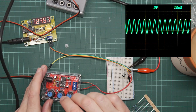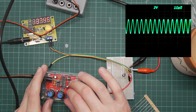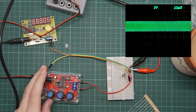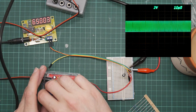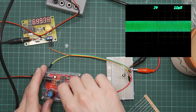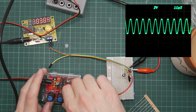That's showing on the oscilloscope about a 10 microsecond peak between two successive waves. And this goes all the way up to, this says a megahertz, that says 650 kilohertz, which I reckon is about right. As you wind the frequency up on this, the amplitude goes down, so it's only just going negative. Yeah. So that was weird.